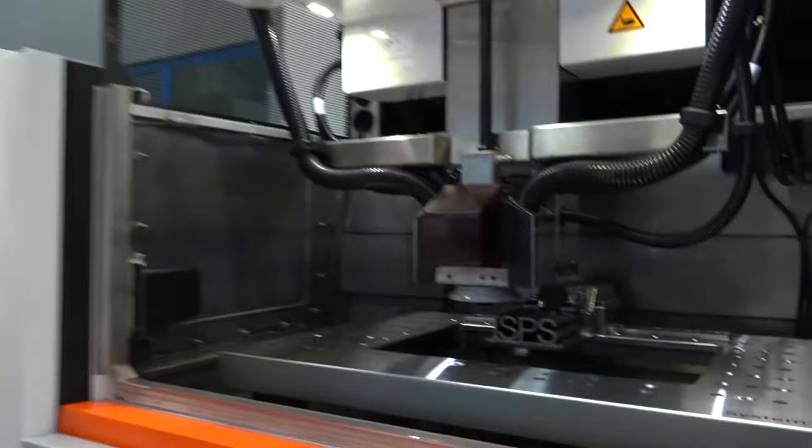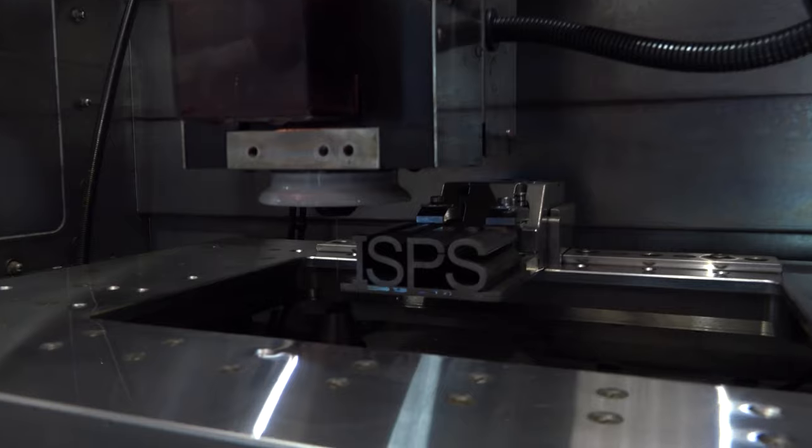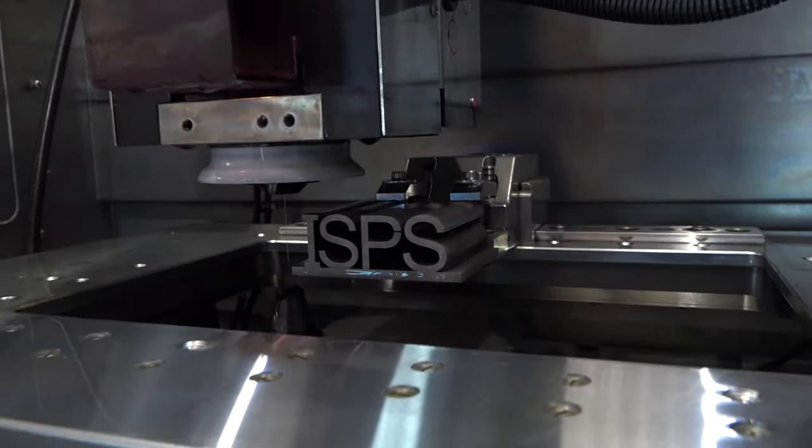Okay. If we can save the customer a cost on that, then we're saving him also cost on production. Okay, so how much would you be saving incorporating these modules from SparkTrack on wire with this application? So with this application here, over a 27-minute cut time, we saved 115 meters of wire.